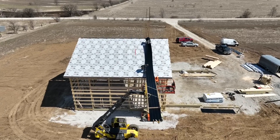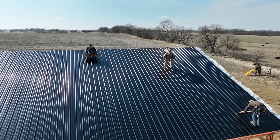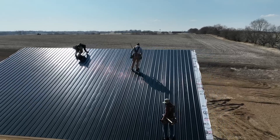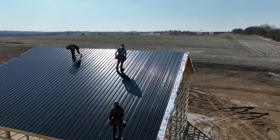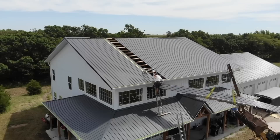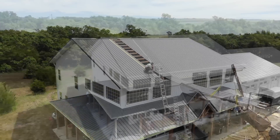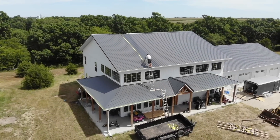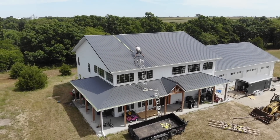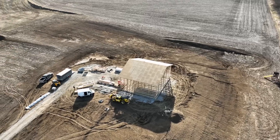Fastener flashings are easier too — it makes putting your metal on way easier. It reduces the chance of your metal getting damaged when guys are walking up there installing it. We did have that happen when our gutters got installed. The gutter guys were stepping, and if you're not cognizant of where you're stepping — if you step on a rib in a certain spot — you can bend it, which means you have to replace it. I don't feel like our house is weak because we don't have sheathing, since we get our shear strength from the metal, but sheathing does add a lot of integrity and eliminates some possible issues.